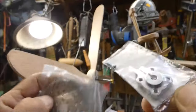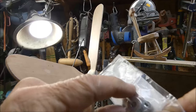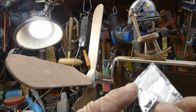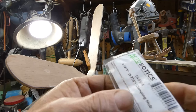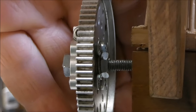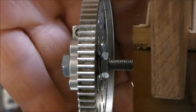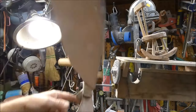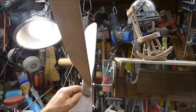I bought one of these bushings and it goes into the hole, which reduces the size of the hole quite a bit. It still won't clamp on the three-sixteenth-inch rod, so I just threaded the rod and used nuts to clamp it together. I've got a nut on either side of that gear — that's how I'm clamping it on there. The 545-584 clamping hub — I really like how it slows down the action, that's gonna be really nice.